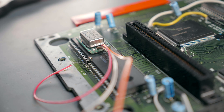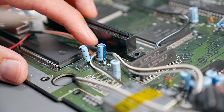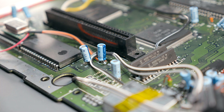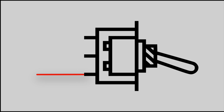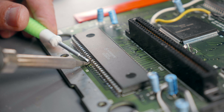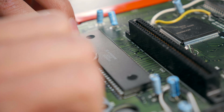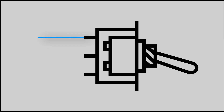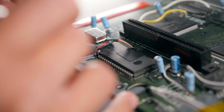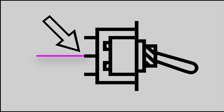I route all my wires to the right side of the board for good cable management. When I wire up the oscillator, I pull ground and power from C65 to get my 5 volts. The toggle lead is then soldered to the bottom pin on the toggle switch. We then locate pin 15 on the processor chip — leg 15 is heated and lifted from the board carefully, bent back, and trimmed. One lead is soldered from the motherboard through-hole to the top pin of the toggle switch, and the final lead is soldered from leg 15 of the processor to the middle pin of the toggle switch.